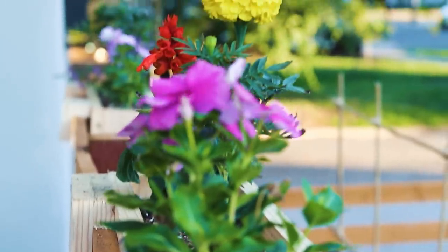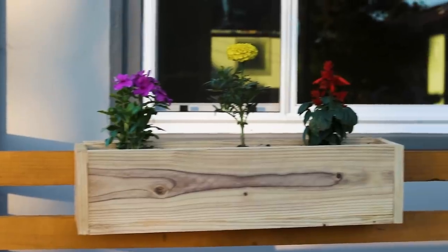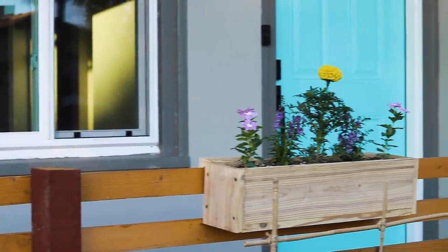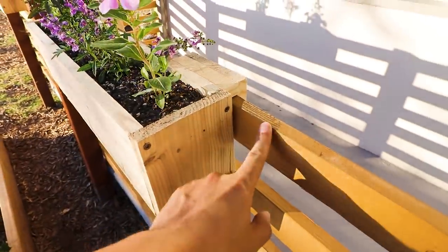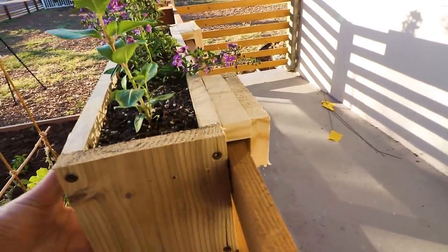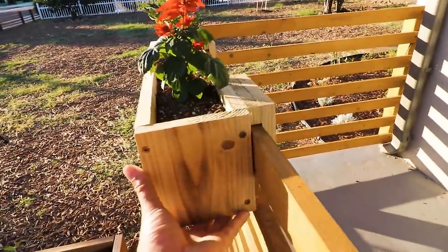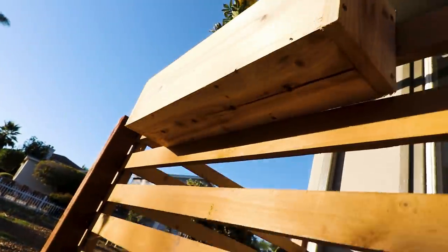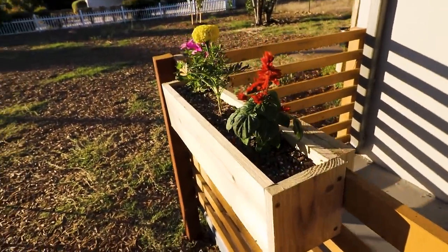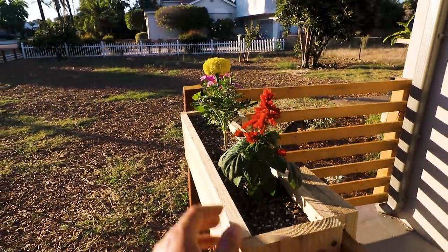Here's something I never thought I would do — designing and building a window box. These are made out of one-by-six lumber with some beautiful flowers planted in them for a nice pop of color on the porch. I didn't want to screw into this one-by-three, so I cut more one-by-six and screwed that together to form a little hanging clip. I improved on the design on the second one, which is a bit more sturdy. Just throw some drainage holes underneath with a half-inch drill bit and you're good to go.